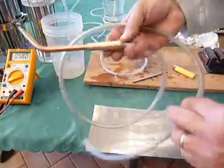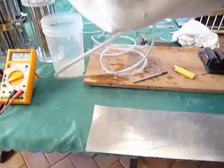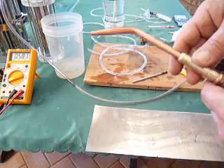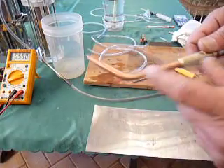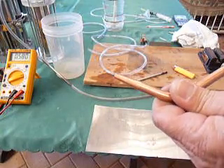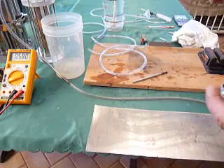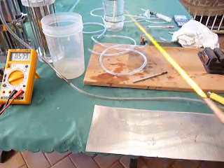Fit this new torch system onto that flashback protection. If you saw the video on making the flashback protection — like I've got in the other torch — I've stuffed some of the microwave oven magnetron heat transfer material in there. It's a very fine woven bronze mat; it's great to put in there for good flashback protection. So that's got a nasty little flame to it too.